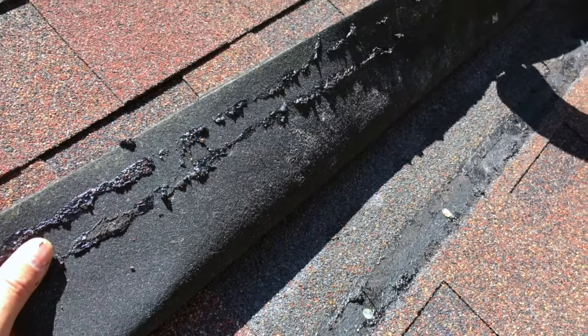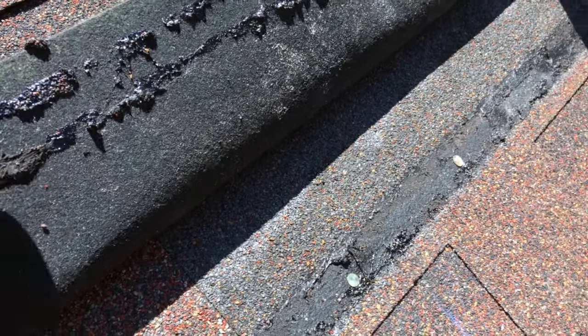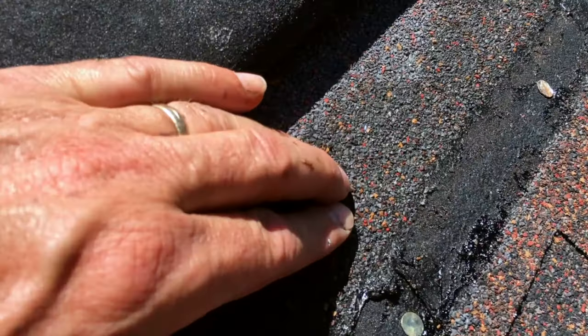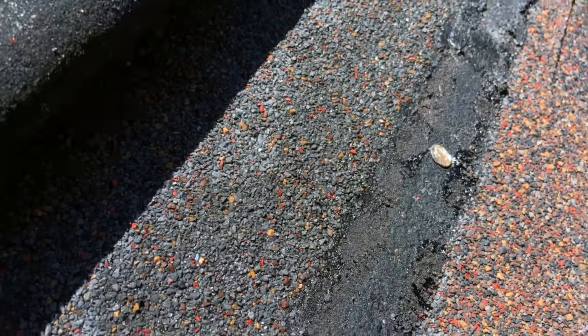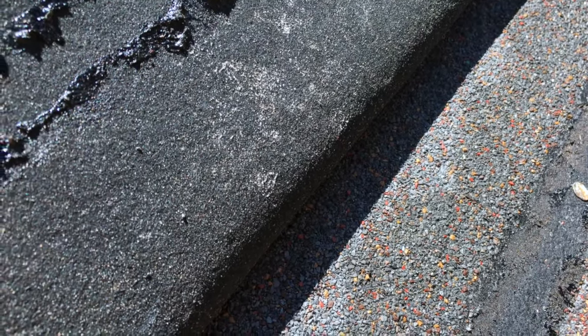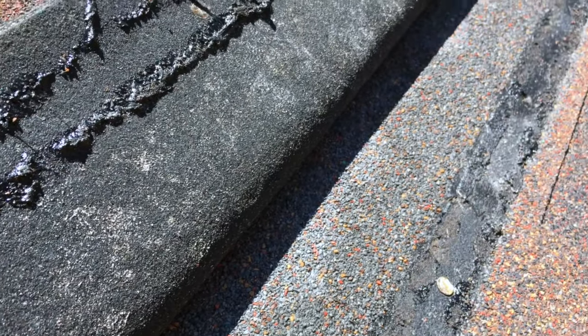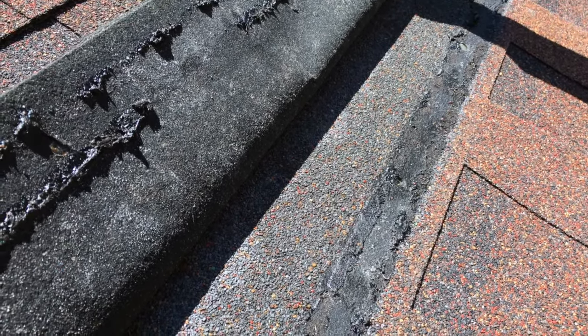We are trying to locate a water leak on this roof, on these shingles, on this particular shingle. I don't know if you're able to tell it, but this is drier up here. Over here, this is wet in this area. And we were two shingles below it. We saw a couple nails that were rusted. And we're going to go ahead and continue uphill.